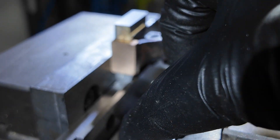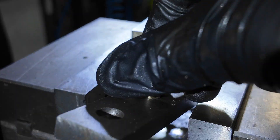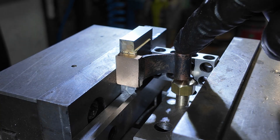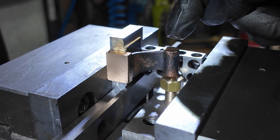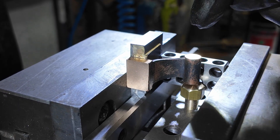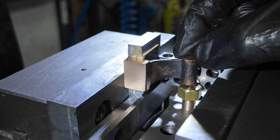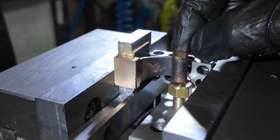What I've got here is I've made this little jack and I'll tuck that under there and tighten that up. That's going to support this guide bush here and we're going to centre on that part and drill through and ream it. The other thing I've got to do is clean up that outer face so that it's round - there's a round collar on the end and we'll do that with the boring bar.